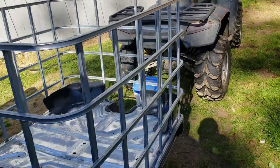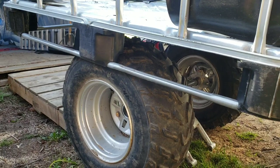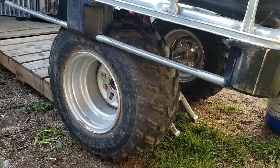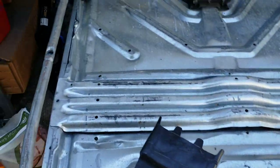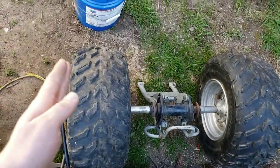I'm back getting this trailer project going — I've got it just sitting on top of my axle right now. I'm going to take these plastic bits out in the middle on both sides, then figure out how high I want it to sit. I flipped it upside down, took the plastic chunks off, and spread both side rails out a little wider. Now I have 38 inches between them because my axle is exactly 36 inches wide from edges of the tires.